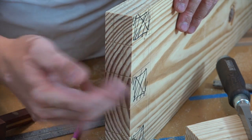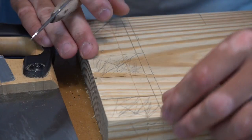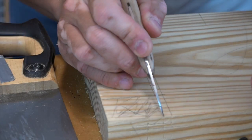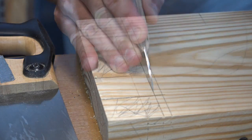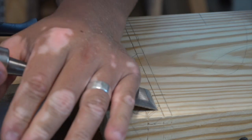I marked this at the same time as I did all the other marking, but I'm just breaking the steps up a little bit. Before I cut across the grain for the shoulder, what I'm going to do is just take my knife and run it into this gauge line, take a chisel, and then I'm going to just clear out a little.